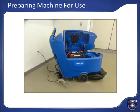To assure successful trouble-free scrubbing performance, there are a few preparation and inspection steps that must be completed prior to a cleaning shift with your CA-60. If the machine's storing steps were properly followed after the previous use, you should find the machine with the onboard charger cord plugged into an outlet, the brush or pad cleaned and either connected or ready to use, the rear squeegee cleaned and in good condition, and the recovery tank empty and cleaned out with the tank tipped out exposing the batteries.